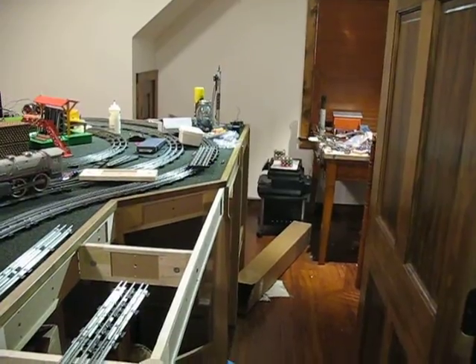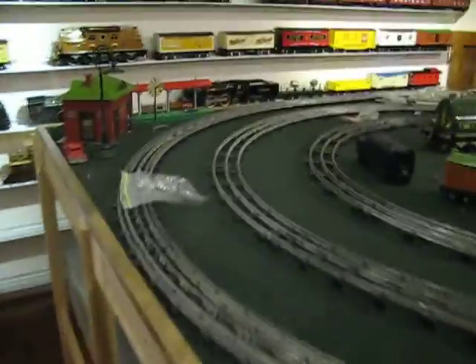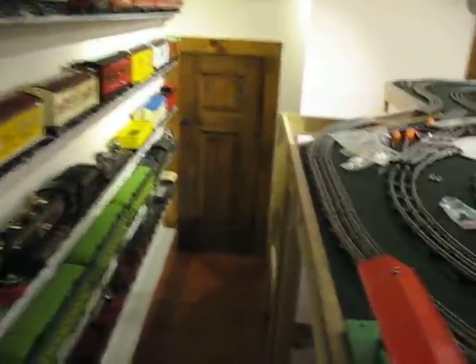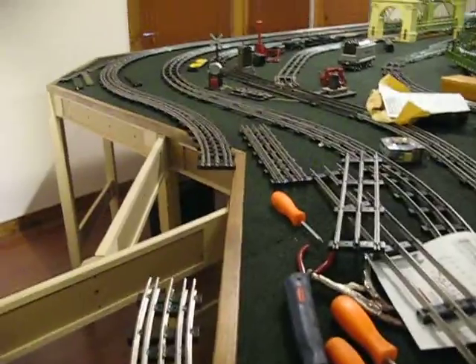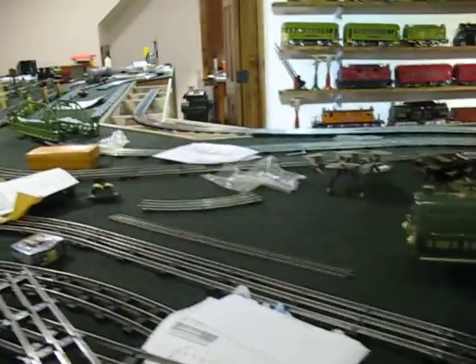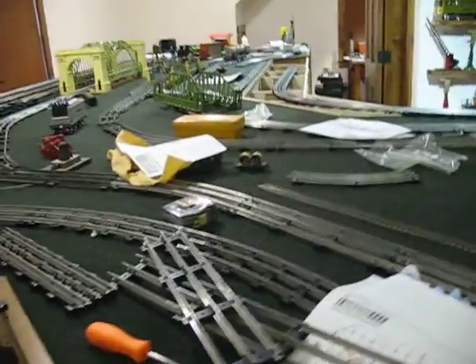As you can see, it does away with that dog leg and goes right up there to be a full, nice 72-inch radius. I've also gone over here and made this a little wider — trying to keep at least two feet minimum between the walls; the minimum is 21 inches. I can still get through, though maybe a larger person couldn't. I've extended it here so this will all have a nice, gradual sweep, with more room in the center for accessories.